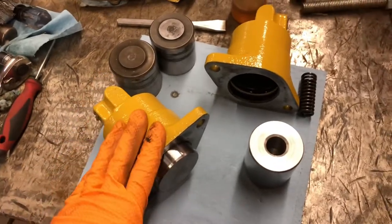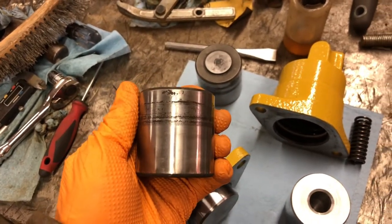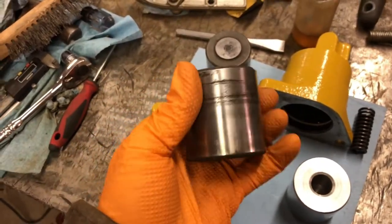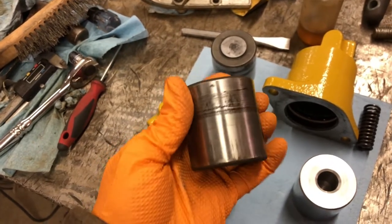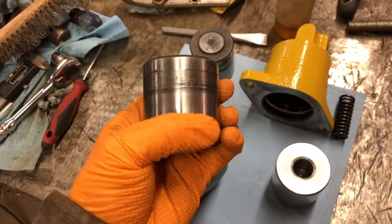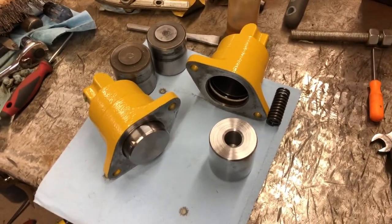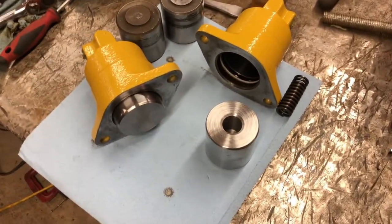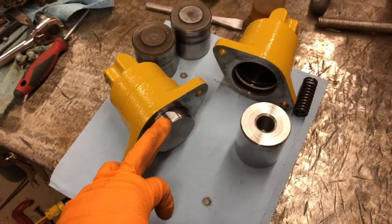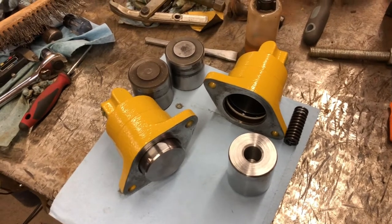I have these rebuilt and cleaned up. I could not find these parts online, and I didn't even bother checking with the manufacturer because I assumed they would cost a fortune. I also did not want to just put these back in because I hate putting something back together that I know is just going to fail again — they're already damaged and rusty. So I ran into Tacoma and talked with the guys at Epic Industrial — great guys, they've done small jobs like this for me before — and they just made me new rods out of chrome moly rod. Having chrome moly rod in here, I shouldn't have a rust issue as far as it seizing up and should not have this problem reoccurring.